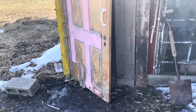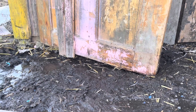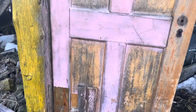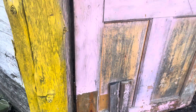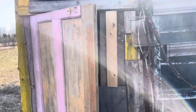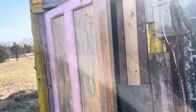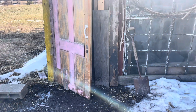The other project I need to work on is this door to the chicken coop. You can see how it keeps wedging on the ground — it's really open on one side and jammed in on the other. So what I'm going to do is actually just saw this bottom part of the door off right below the hinge and make a lip so that the door swings over top of that and that bottom can stay secure. The birds will be able to jump over it and that will fix that problem. Once I have that done, I need to fix this latch at the top by removing the board that I put in and getting that a little bit more secure. I definitely feel like this project is more of a priority and I don't think it's going to take very long.